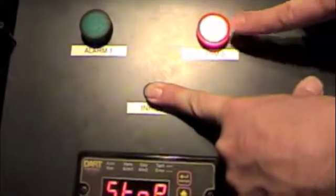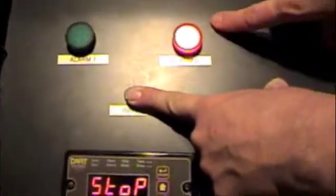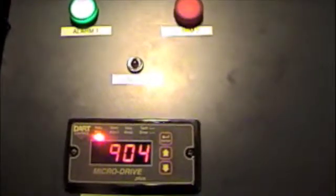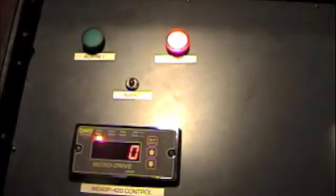I've got this one set up to 2 conditions, either 0 speed from my 4-20 or an E-stop command. As soon as I release it, the pump running light comes back on and the red light goes back off, just what you'd expect in a normal condition. If I go all the way to 0 speed, the pump running contact goes off and the other lamp comes on.